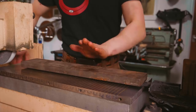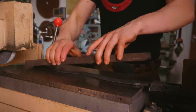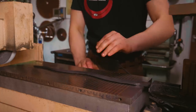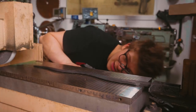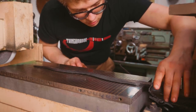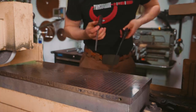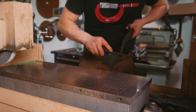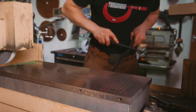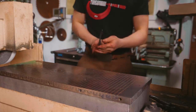We've gone for hardening cycle number three. There was an issue though — we went for the magnetic warp straighten again, but I don't know how much that did. Oh boy, that's a warp. We have an eighth of an inch of warp across this. Now is it hard though? This file is not touching it. Third time — what's the charm apart from the warp?